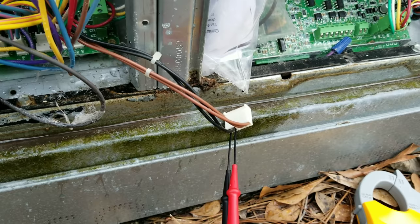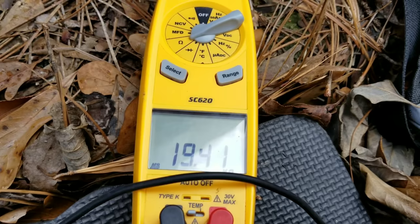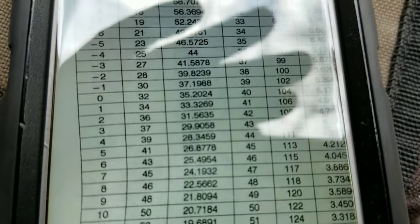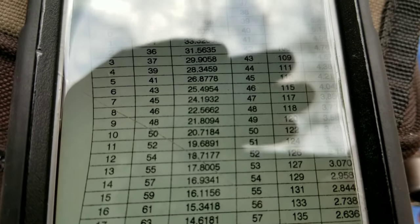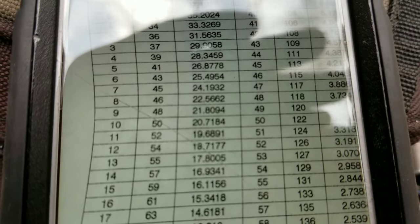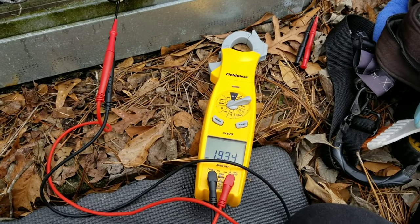So we have our little harness disconnected. The two black wires are the outdoor sensor and the two brown wires are the outdoor coil sensor. I'm ohming those out right now — you can see our outdoor sensor is reading 19,400 ohms. I do have a 10k ohm resistance chart here, so we're going to go down and find 19,500 or somewhere close. Right in the middle of the screen there is 19,600 — directly to the left of that it reads 52 degrees Fahrenheit, and it's about 49 to 50 degrees out here. So that sensor is reading fine.